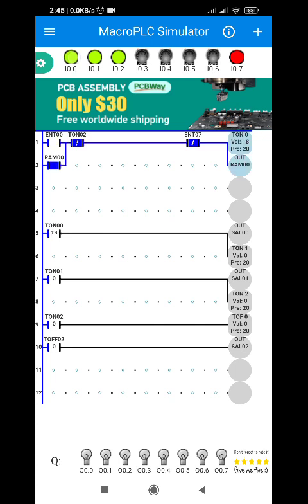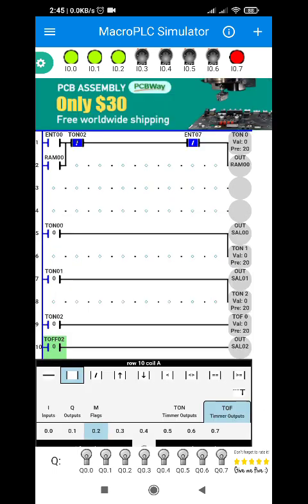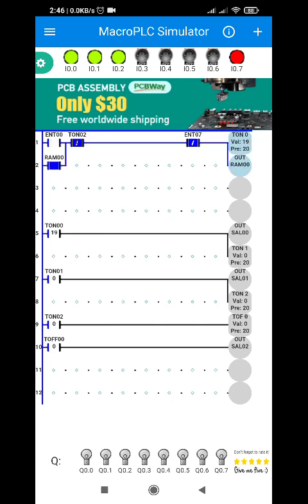Let's try this program. I'm just going to troubleshoot first. The issue is that I selected TOF 0, but in this input I selected TOF 2 — that is the problem. I'm going to try again. The first and second bulb is turned on, but when they're turned off, a new bulb is turned on. But after 2 seconds, it is also turned off.